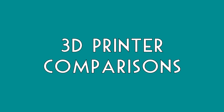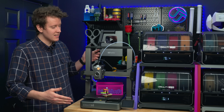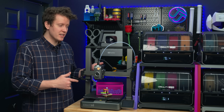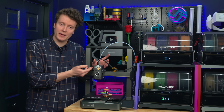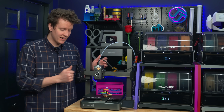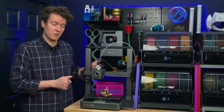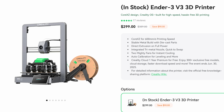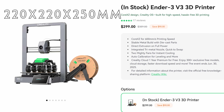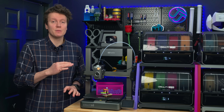We need to talk about other printer options. The Ender 3 V3 is largely the same with a similar metal chassis, but this one comes with several big upgrades. The extruder and hotend is a big improvement — it's got the filament cutter and run-out sensor inside, and the larger cooling fans should improve overhang performance. It comes with a built-in camera, RFID, and a bigger build volume. The Ender 3 V3 only has 220x220x250mm, so this is 40mm bigger on X and Y and 50mm taller.